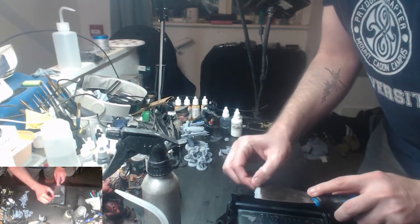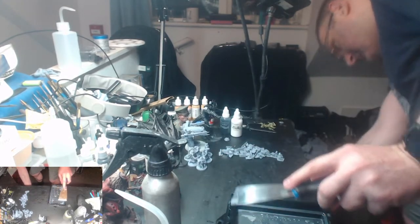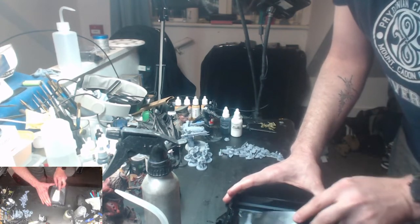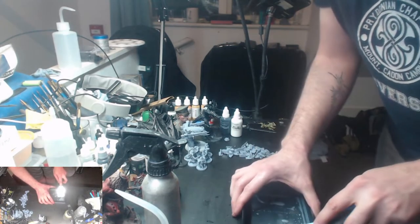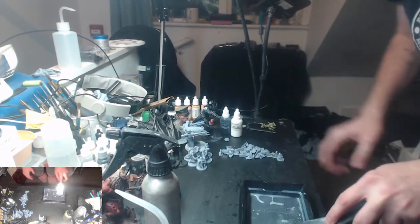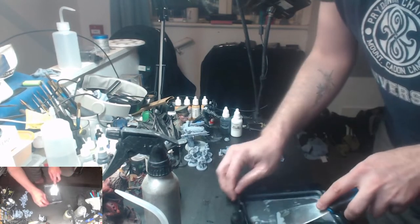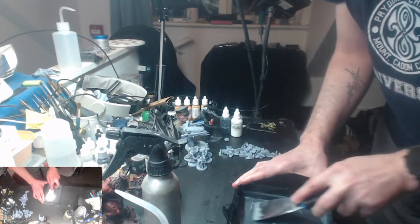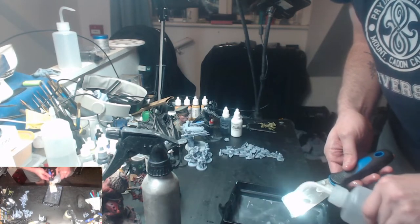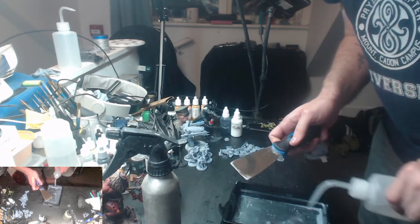As you can see, that's not part of my print. That's what's known as webbing. Artifacts. Print artifacts. And there's also some print artifacts showing now on this side too, that are constantly showing. Now, normally, I use some IPA here real quick, just to cut it.